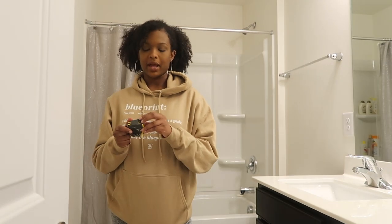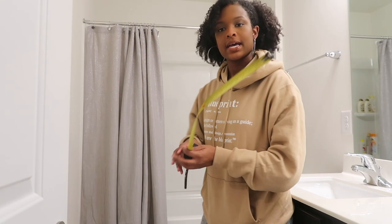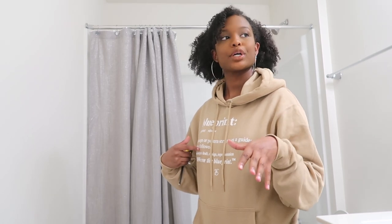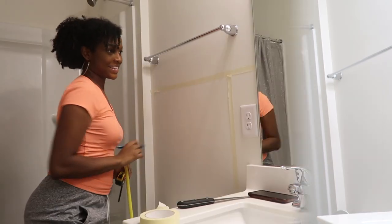Before I get supplies I need to measure out this wall because I'm doing some paneling and I need to know my distances. Most times I get everything cut at Lowe's, but I'm going to buy a whole bunch of MDF panels — like we did with the molding downstairs — do my mapping out per panel and then cut them here instead, just to be sure. My longest one should be at least 93 inches.